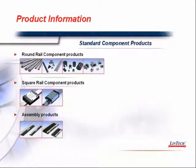Twin rail shaft assemblies include two shafts that are mounted to a common base which maintains the shaft parallelism over its full length. This greatly reduces the setup time for a customer to take two single assemblies and mount and align these to his base plate. The TRSA is available in the same shaft options and diameter and length combinations as the SA.